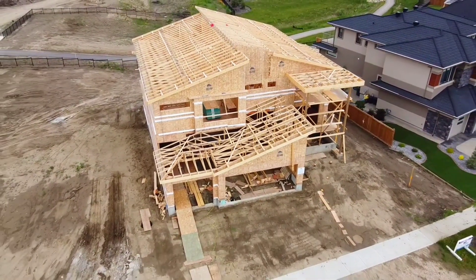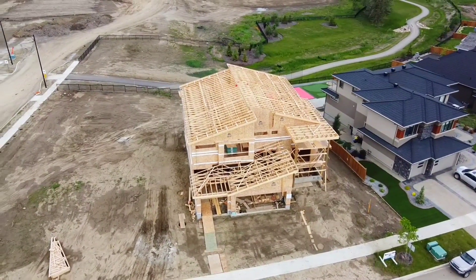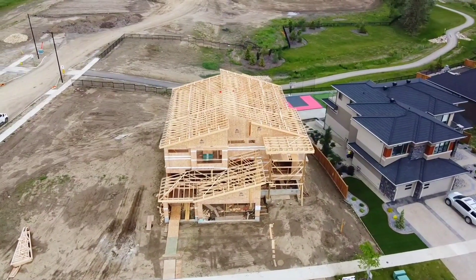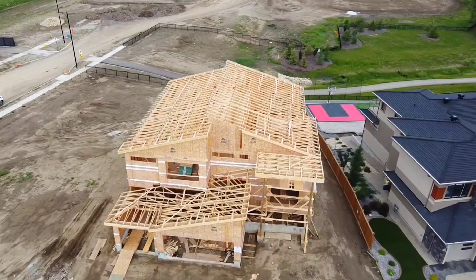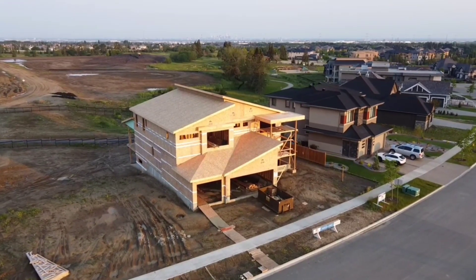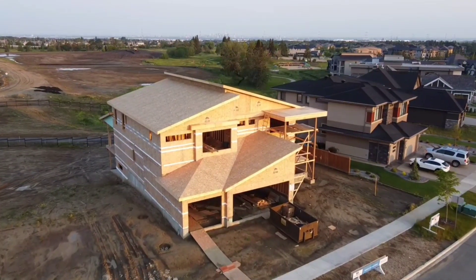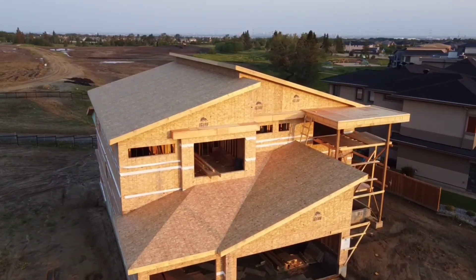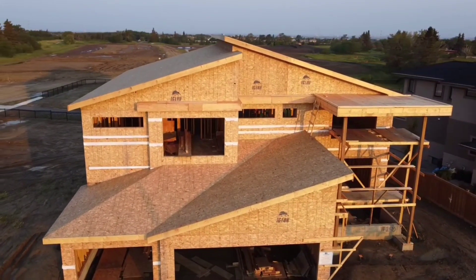But in reality, that's when the start of the real roof framing comes in — hanging fascia, lateral bracing, hips and valleys, ridge blocks, gables, tray ceilings, drywall backing. Piles of blocking are installed to prepare for the sheathing. Then with the start of the sheeting marks the end of walking trusses, and sheeting itself goes very quickly. It always gets a lot of smiles and back-patting, although it's notably the easiest and maybe the most fun part of framing a house — it certainly has great curb appeal.